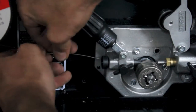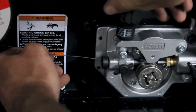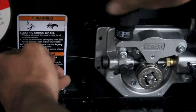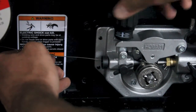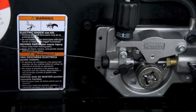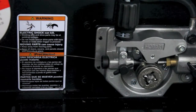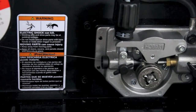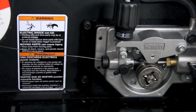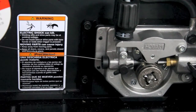Once you get her going, then you flip this back down, take this, and crank it back down. I ran it on 3. I need to see if I can read and figure out what the proper tension setting is, but somewhere around there it seems to feed pretty smooth for me. And then it's fed in there, and then all you have to do is just press your trigger and it feeds it through and you're ready to weld again.